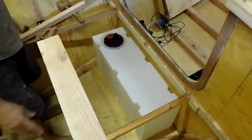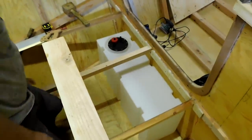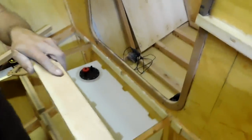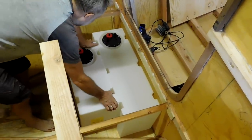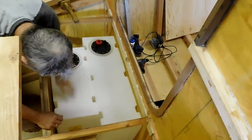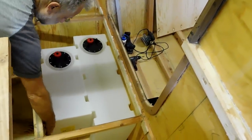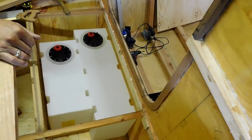Beautifully. You'll see the forward bunk under construction here. Look, I've got the various pieces. Support pieces, 1.5 square Douglas fir supports. Good. Would you mind just cutting for a tick and pass me that other tank? And there they are. They fit in there perfectly. That is just complete coincidence, luck. But from that bulkhead to the batten on the bottom of this bulkhead, that tank is tight in there. That's amazing. So I just need to put a batten across in there to fill that gap out, and something across the top of them, and they're fixed in place.